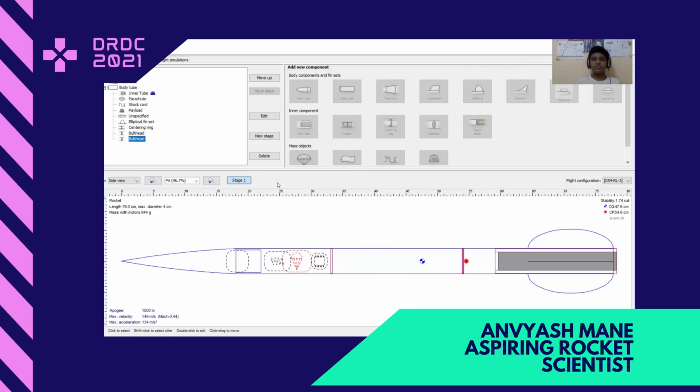After that, the systems that I'm telling you about, the system is one TVC, thrust vectoring system. It actually pivots the motor to control the rocket, mainly for stability. It is used in rockets like Falcon 9. You can see the engines move. But now it is brought to model rocketry also by BPS Space. So I'm using their TVC mount and inner tube.